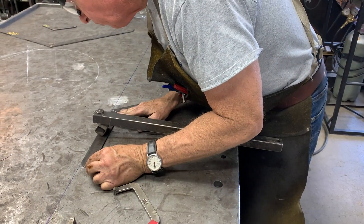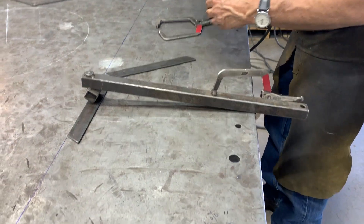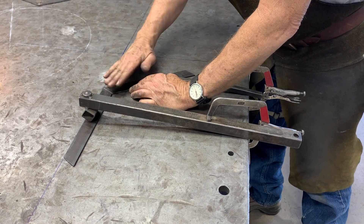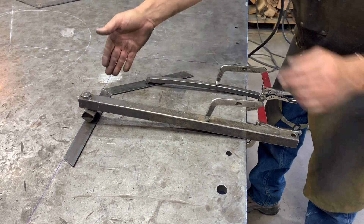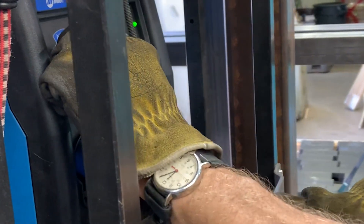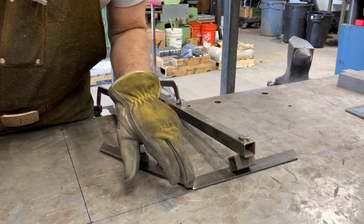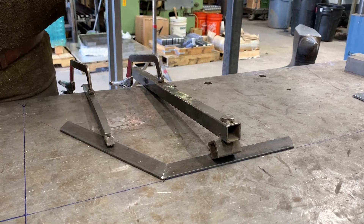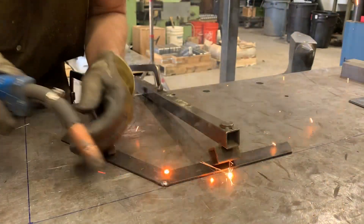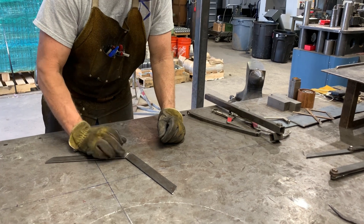The first thing I'm going to do is check to make sure that I am right on that line, then put a little bit of pressure. I'm using my Miller Matic 211, set on about a quarter inch and maybe 55 on the wire speed. The weld sequence: I'm going to tack here and tack there — that's all I'm going to do right now on this side. I'll do a light weld here and a light weld there, grind it off, and show you how to adjust if I'm off a little bit.